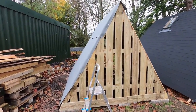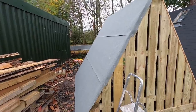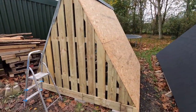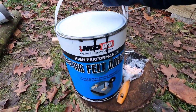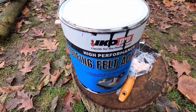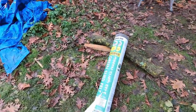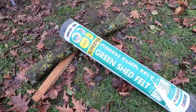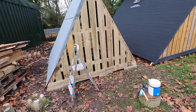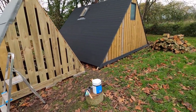This morning we're finishing off felting the roof. We did one side as practice, since we've never felted a roof before. We're following the instructions: we've got roofing felt adhesive which you paint on — it's really thick gloopy stuff — and you leave it 15 minutes to get tacky, then we've got normal green shed felt to lay on. We've done it so that the rain water will nicely run off and not get underneath. Let's get painting.